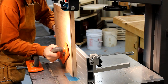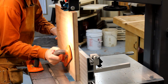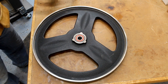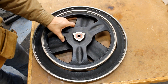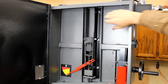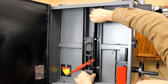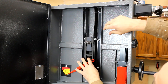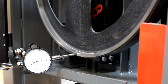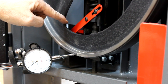Now let's take a look at some of the key differences between the 14BX and the 18BX. The 18BX has a pair of massive 18-inch cast iron wheels that weigh more than double those on the 14BX. The wheels on the 18BX are attached with a heavy duty cast iron bracket compared to a lighter steel bracket on the 14BX, which is appropriate as you scale up the size of the wheel. This helps keep deflection to an absolute minimum under heavy cutting pressure. With a dial indicator hooked up, I only measured two to three thousandths of an inch of runout, which makes this one smooth running wheel.